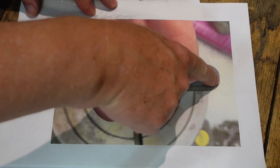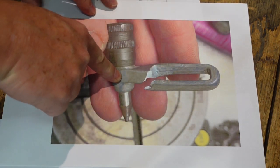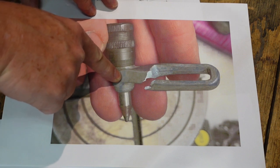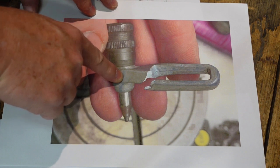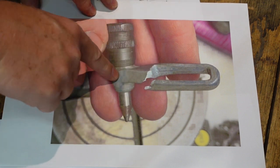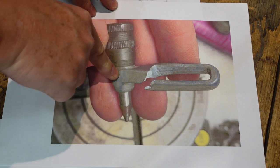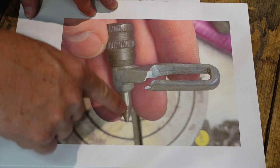This was the starting point. It looks like it's made out of a die cast material, probably a zinc alloy - not known to be terribly strong, easy to produce, it's a low melting point alloy. Once they break you can't really do much with them, and you can possibly just see there are some signs of cracking in there too. That's another thing I find with this sort of alloy - after a while it tends to want to disintegrate.